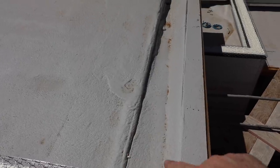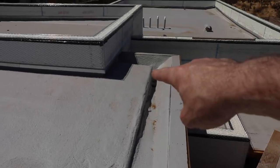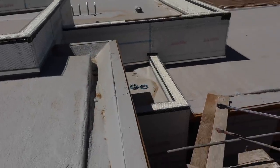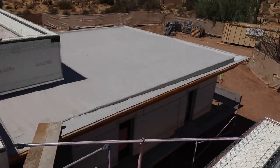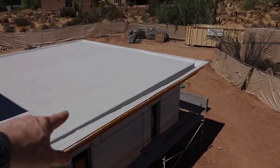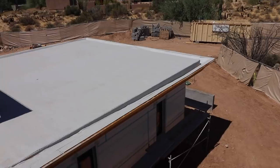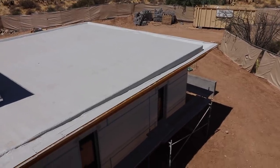As you look at this house with all these flat roofs, it's really interesting to see how they've sloped it with the foam. The spray foam guy is spraying heavy up high and lighter down toward the drain — so maybe only an inch of foam at the drain and maybe four inches up here, creating that slope. This house also has several areas with an internal gutter system and a really fun fascia detail. I've got a mock-up to show you what that looks like.